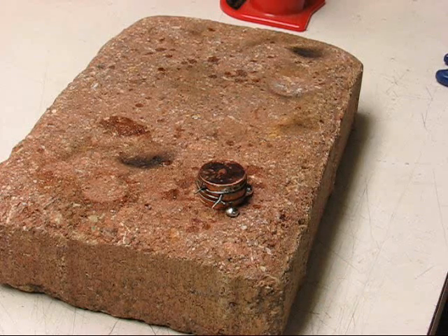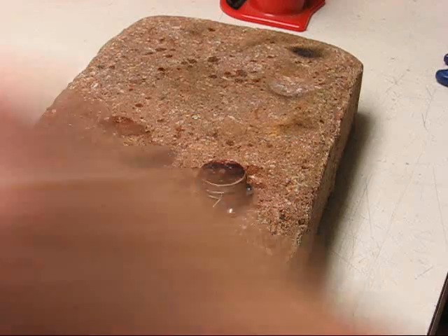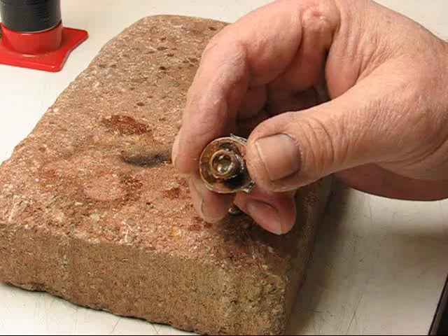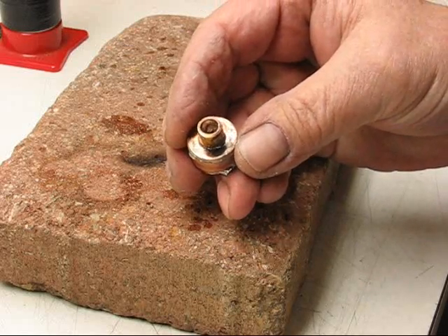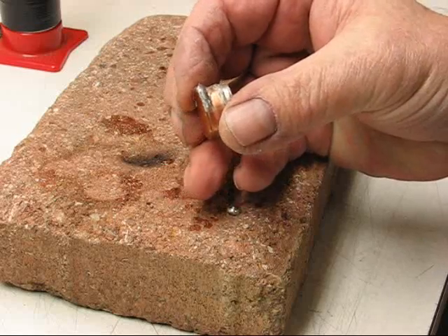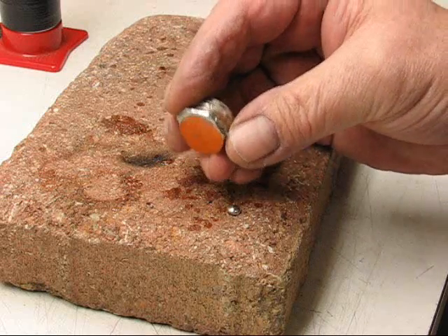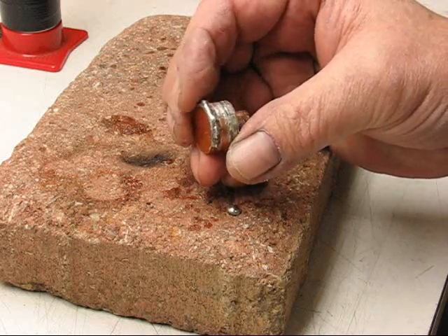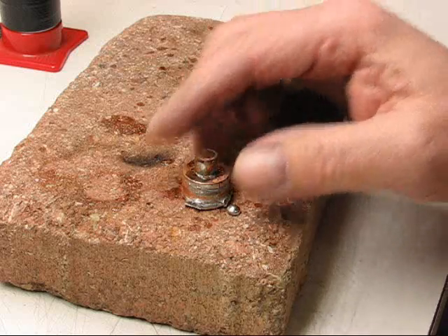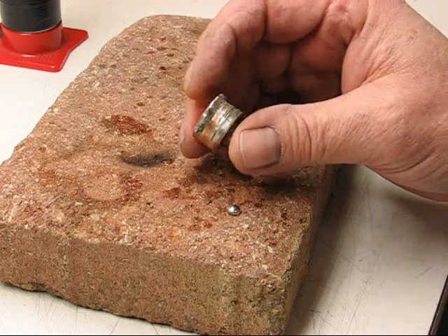Anyhow, that's how I'm going about getting this heatsink made for this 3-up. The last thing I'm going to need to do is make a center post — I have a couple and I'll have to solder that on here too. I've got the center post soldered on now — that's the positive terminal. The heatsink has a lot of excess solder, very heavy, which it's going to need for the 3 LEDs. I've got a lot of cleaning up to do. But that's pretty much how I make these things. When you don't have the right stuff, you make do with what you got.